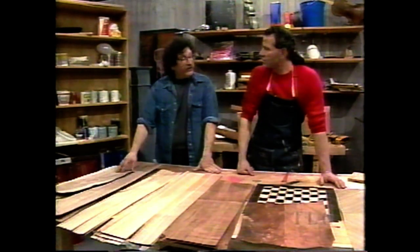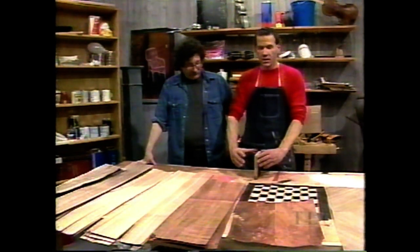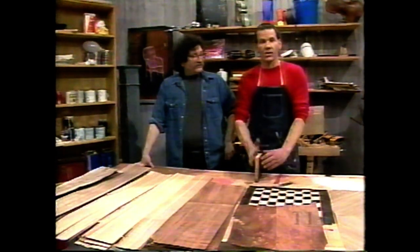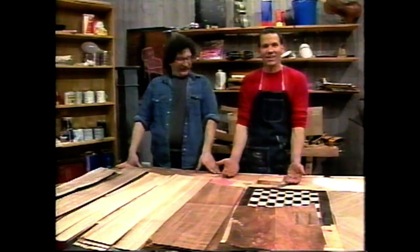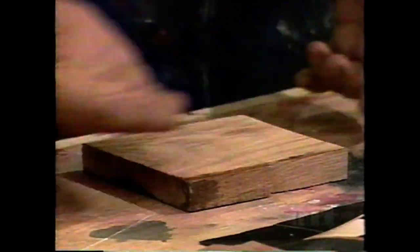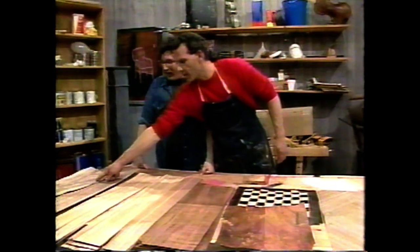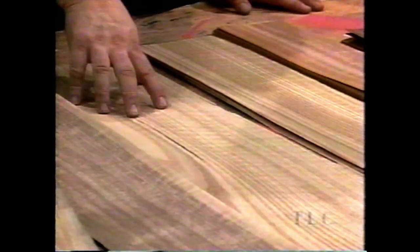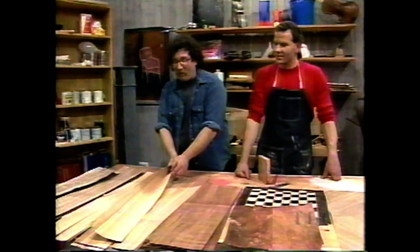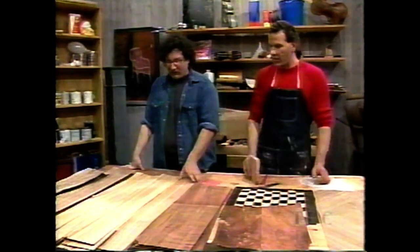Let's say this is a tree — just a block of oak. If this were a tree cut in half and you take a big saw, cut it down and it falls — it is felled. The veneer cut off of this portion like that is plain sawn. From the edge, cut it like that — that is a rift cut. And this is ash. A baseball bat is made out of a block of ash turned on a lathe. And here we have mahogany — this is Honduras mahogany, and this is Amazon mahogany, which is more expensive and usually made for fine furniture, bar tops, and whatnot.